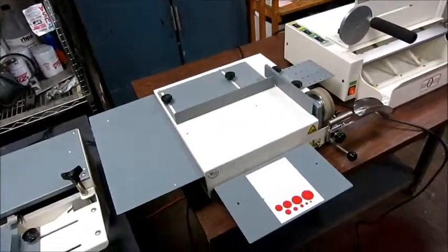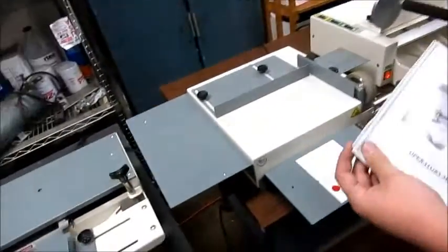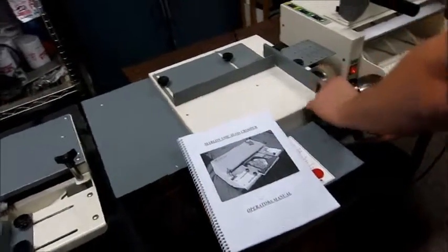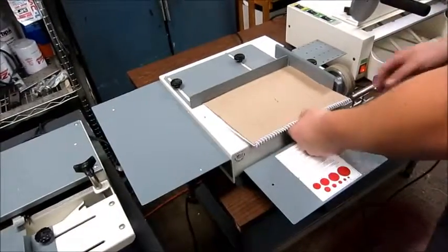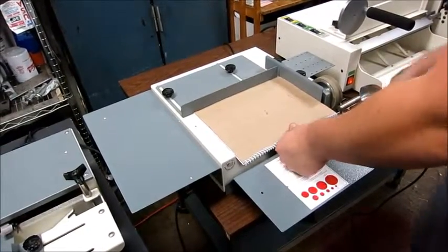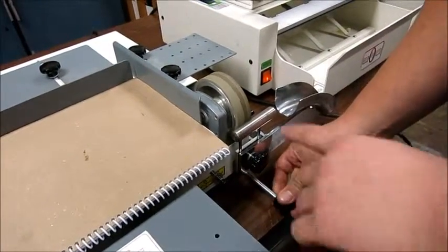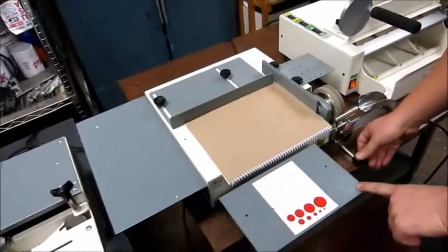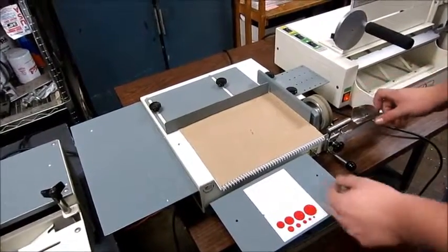This is your coil inserter. These guides change out — they can come out and are different sized coils. How this works: you set your guides up here with the coil not yet in the book, just after you've punched it. You slip the coil on here and use this lever — you can run it forward or reverse. When you drop it, it spins the coil into the book. It's activated by dropping this knob down. It has a guide here for all the different sized coils, and you can get different dies for all different sized coils.